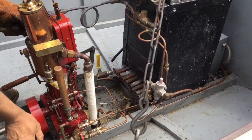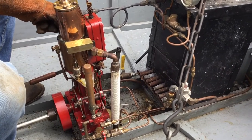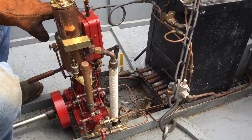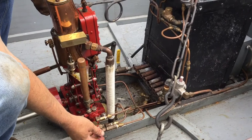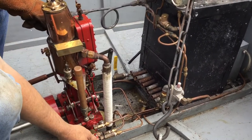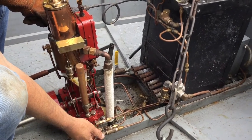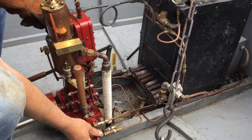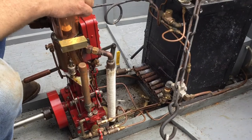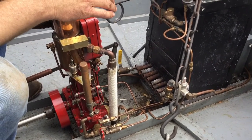Here we go. Normally when you're on the lake, this will be almost wide open here, and you're going to work on the bypass here. Right now I've got 100% water going into the boiler to make steam. If I'm making too much steam, I'm going to open that up. Notice how it's dropping down — and the pressure's dropping down. This thing is real sensitive here, so 90 to 100 is good if you want to work on saturated steam.